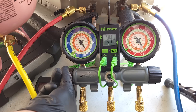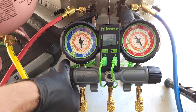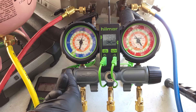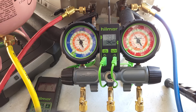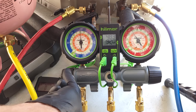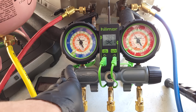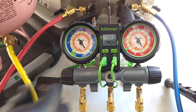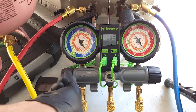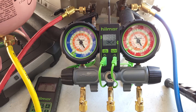We need to get up to about 10 degrees of subcooling — so 9.7. You can tell if you are adding too much refrigerant at a time if you hear the compressor noise change, and that would definitely say slow down on your charging. We have 8 ounces in. Let's hold that and wait a couple more minutes and we'll check the refrigerant charge again.